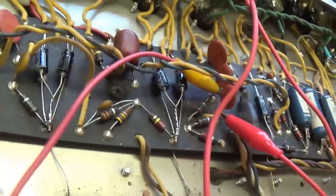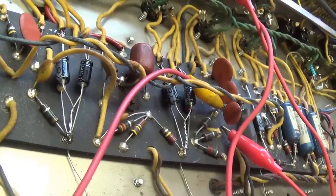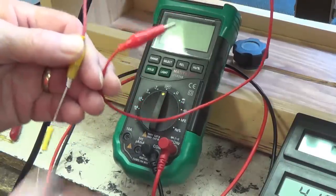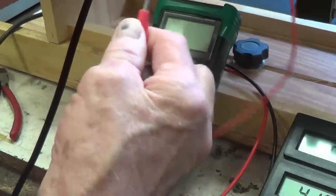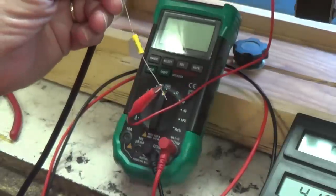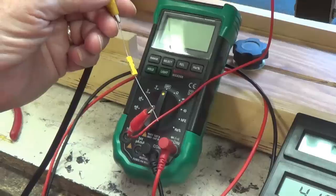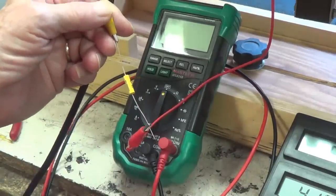I'm going to put the camera on the tripod now and we'll try it with and without that supplemental 0.01 microfarad cap. Okay, the tremolo is at its lowest speed of 1 and intensity of 9. Now listen to the speed drop when I connect this supplemental capacitor. Probably about half speed. I think that's slow enough. Let's go ahead and hardwire in this cap and test it again.